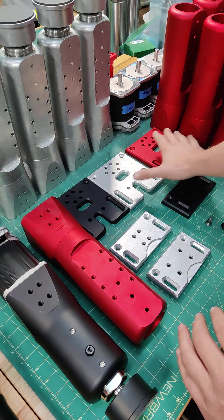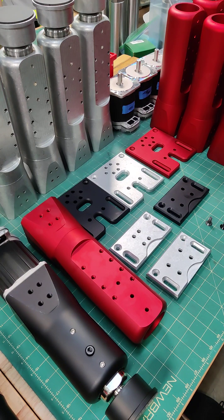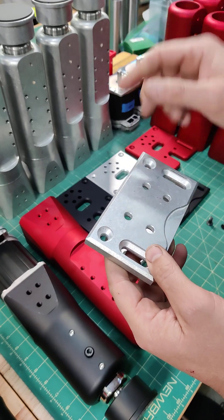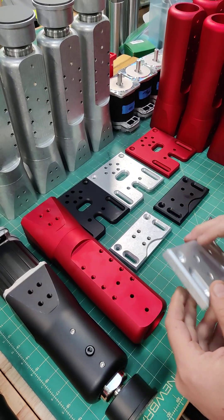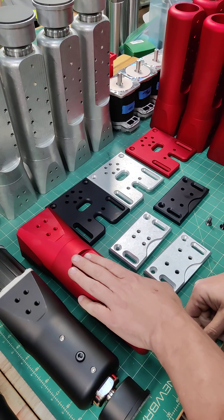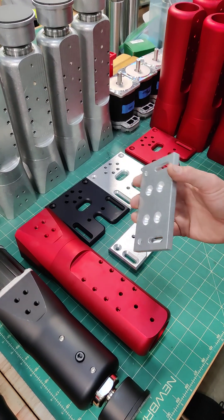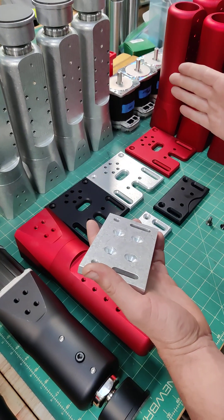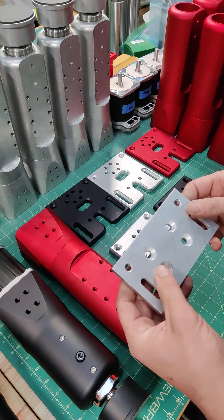You also have two color choices with the extended bracket as well as the DK6 bracket. Just to hone in on the fact that the bracket is very important — these are milled out of 6061 aluminum here in our factory and sold directly to the consumer. It needs to be solid, because it's going to go through years of abuse, vibrations, motion, and sudden changes of acceleration. Also, keeping the bracket really close to the extrusion is important. Anytime you push the bracket off the extrusion with any kind of mount, you induce flex or yield over time.